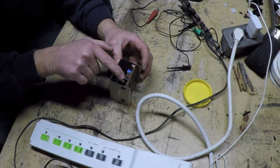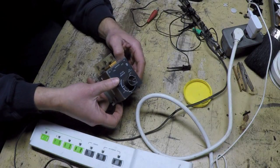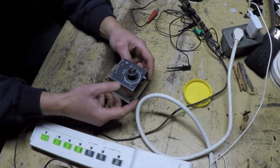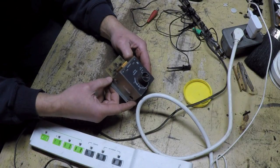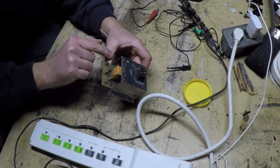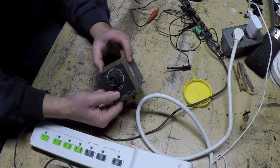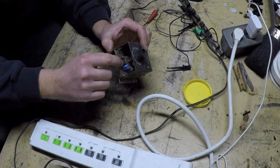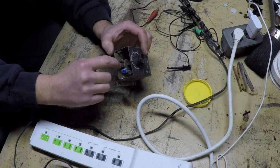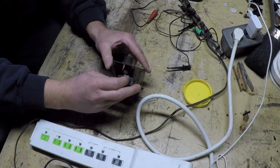oh, there's a third one there, a little one. Let's see, how many are in the circuit completely? I see a small 8-pin IC chip, a couple of diodes, a couple of resistors, a relay, a large resistor, a disc capacitor, an old style transistor. This looks like a trim resistor right here that's been preset at the factory, and then they sealed it with some sort of sealant. So there's really only three electrolytic capacitors in the whole circuit here.